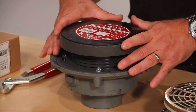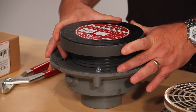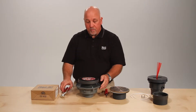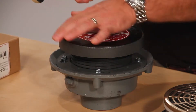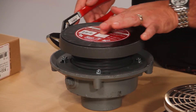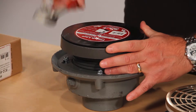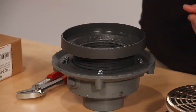When the finished floor covering is selected — whether it be tile or colored concrete — that is when the coring plug is removed. To remove the coring plug, you simply tap around to remove any concrete that may have settled around the coring sleeve. Then there's a slot — take your channel locks and remove the coring plug. The coring plug is then removed and discarded.